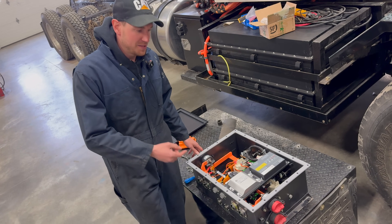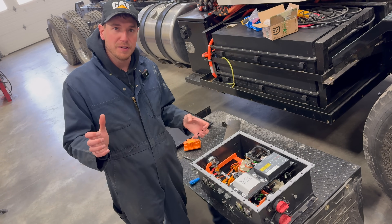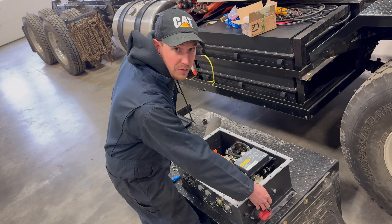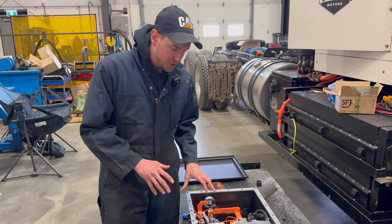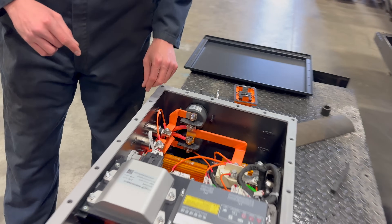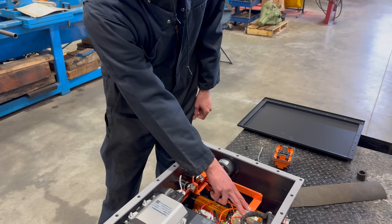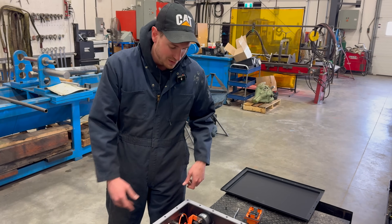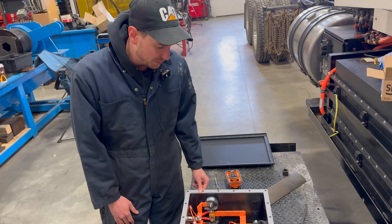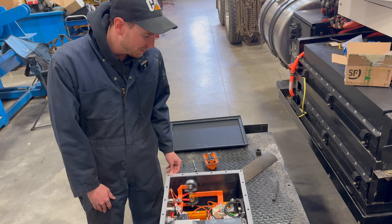The reason we ended up going with these disconnect switches — these red switches here — is because the original design revolved around fuses that we had to literally take out physically, which was quite annoying. With the disconnect switches, you have a nice switch you can turn, and you can even lock it for safe use. The other reason this box is safer is the original design had both battery connections connected directly to an input on the contactor. Now we have a degree of separation — they go to their individual disconnects, then to the main contactor — making the system truly isolated. It's a far better design, a lot safer to work with. Really happy we were able to improve on this in such a short turnaround. We thought about doing this about two months ago, and here it is — really quick prototyping on our part.